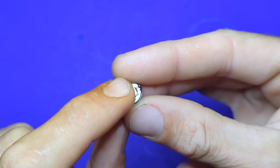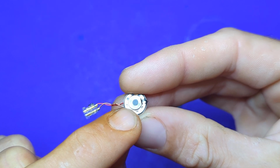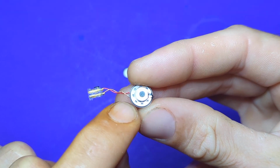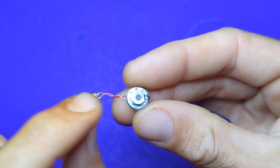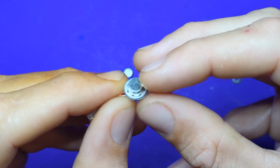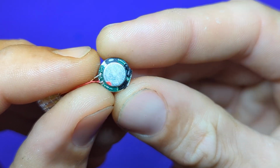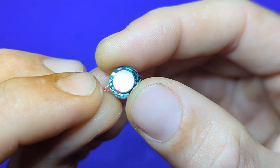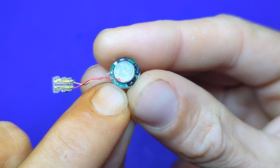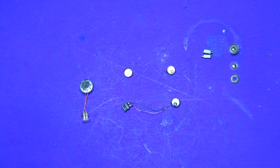And part of this design is kind of cool because in a speaker, most of your mid highs come from the center dome. So the way this is stacked on top of each other, this actually blocks the dome. So the residual sound you get from this surrounding area here is more of the mids and the bass. So it lends itself well to having this tweeter on top. And then there is a crossover unit right there. It's just a small, tiny little capacitor. That's all it is, just an itty bitty capacitor that they used, and that is what filters the mids and the bass from the flat panel.